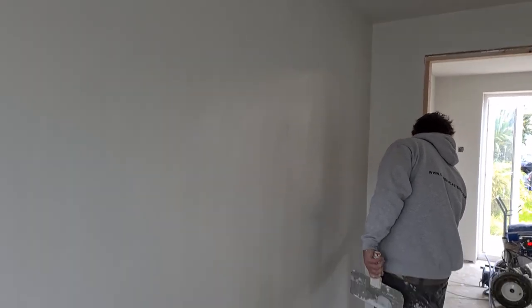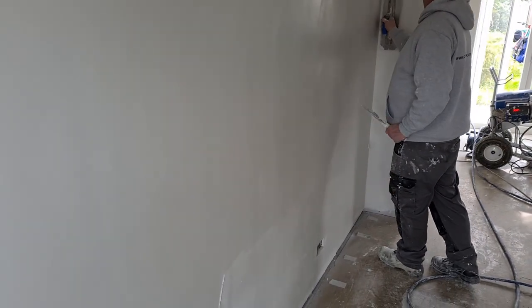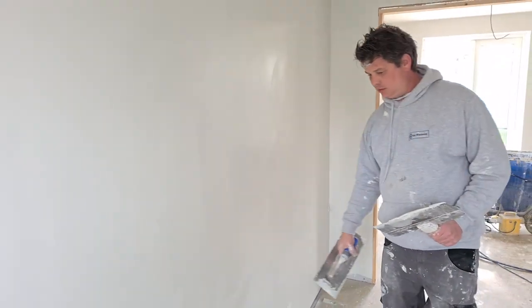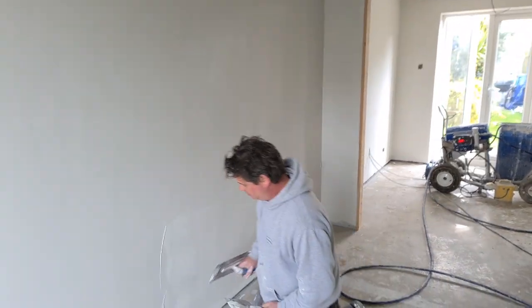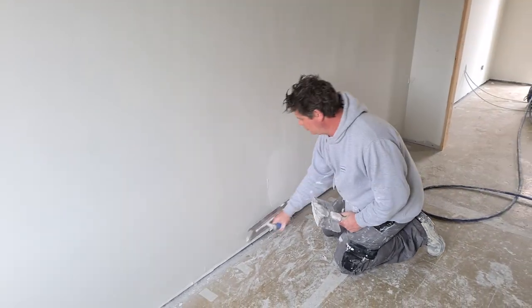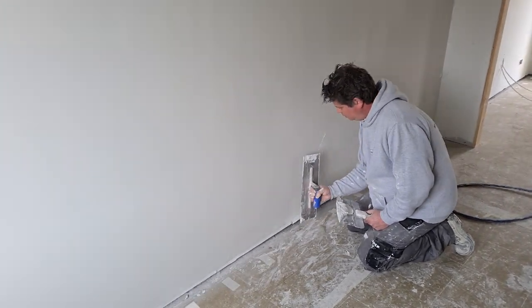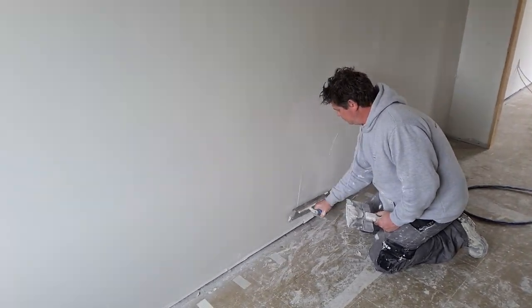We found the width to be too narrow, and we'd end up hitting the inside edge of a corner with our hands when we're trailing off the opposite direction. And the Rafinas were a bit wider, so that stops happening. But we haven't bought any trowels for quite some time, so we've been happy with our Rafinas. Just don't drop them off scaffolds or towers, because obviously they're damaged very easily.